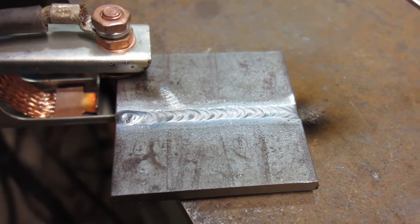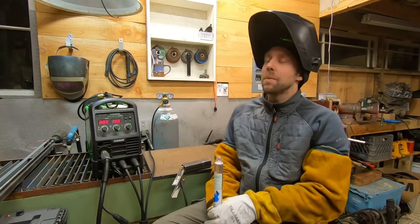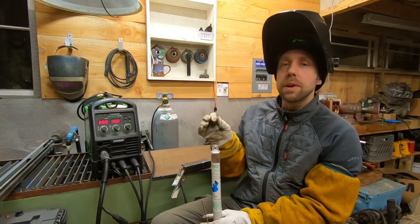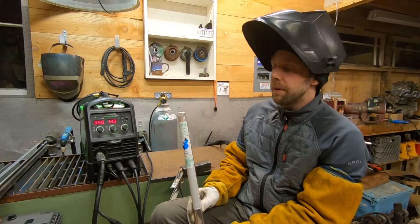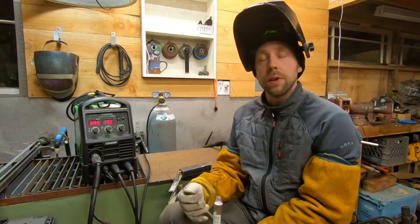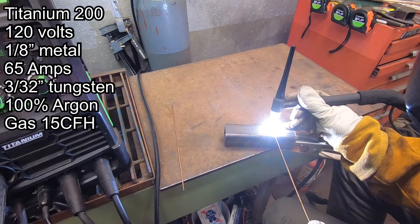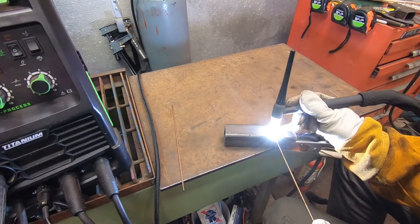We're going to do a little bit of TIG brazing. We got some eighth-inch tubing and we have the Titanium set to 66 amps — 65 would do just fine. The whole idea with this bronze brazing rod is you don't have to melt the base metals; you just have to heat them up and blend in the rod. This stuff is different than your oxygen-acetylene brazing rod, so that stuff really won't work right for TIG brazing. I couldn't find it locally so I found it on Amazon — there will be a link below. Other than it looking like a really cool joint with that bronze look, it's good for artistic stuff like coffee tables and furniture. It's also good for repairing cracks in cast metal and for joining dissimilar metals — like steel to copper, steel to bronze, or bronze to copper.